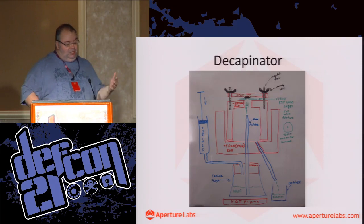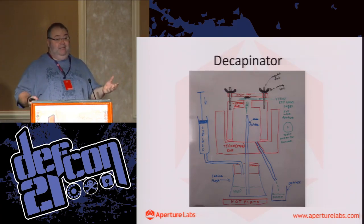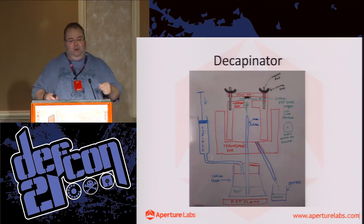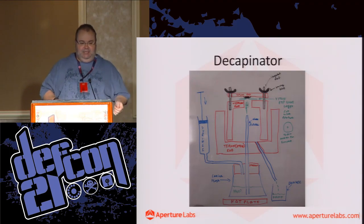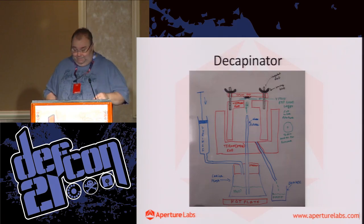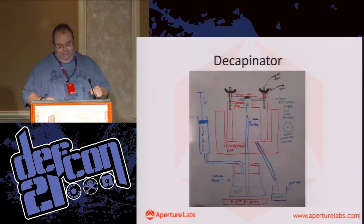And I realized that actually the cheap stuff works because I'm only exposing it for a reasonably short period of time. The Viton ETP 600 is designed for making gaskets for pipelines that are pumping nitric acid and shit like this. When you look at the specs on how they test the regular Viton, it's like, okay, we're going to immerse it in nitric acid for 24 hours. And it's like, oh yes, and it expands 5%. Okay, that's fine. It's going to be nowhere near 24 hours. And even if it did expand 5%, who cares? Not with the stuff that we're doing.